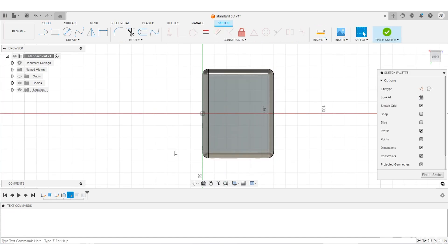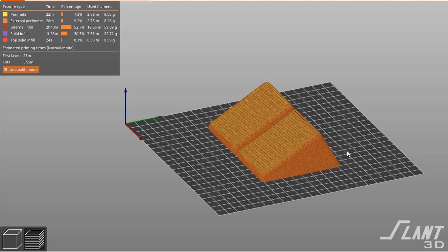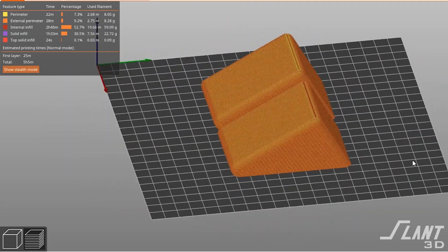One of the simplest solutions is to take the enclosure and instead of cutting it straight across, cut it at an angle. If you cut it at an angle, you've made the two halves print as individual pyramids, which means the layer lines go all the way around the entire circumference and outer perimeters of the part. This means the outer surface is much more uniform. It does affect your geometry a little bit, and if you have internal components it can affect how those are mounted. You don't always have to use a full 35 or 45-degree angle — it can be more subtle.